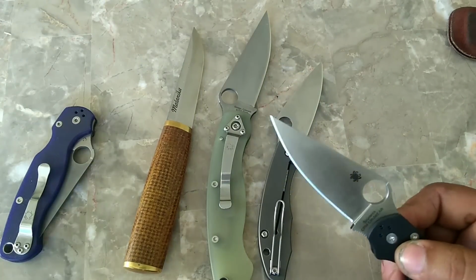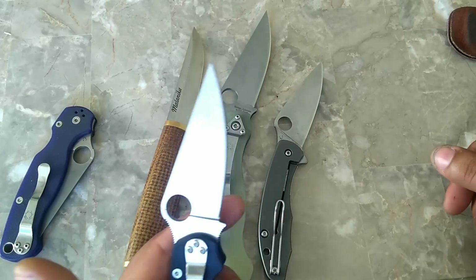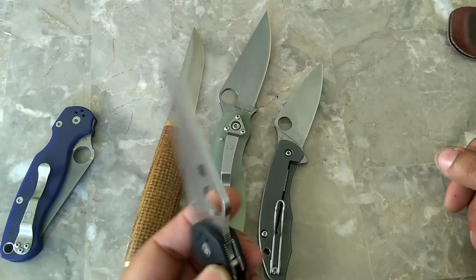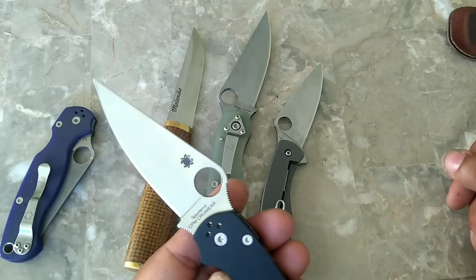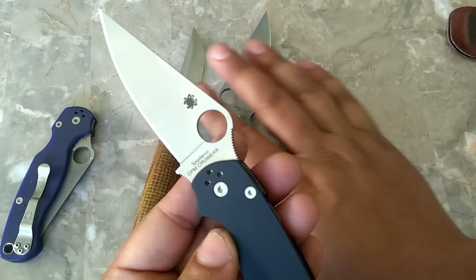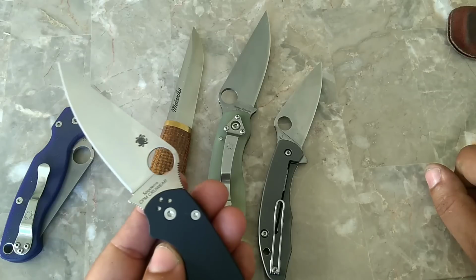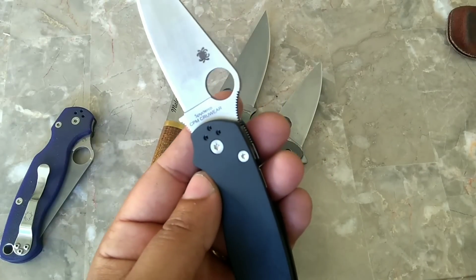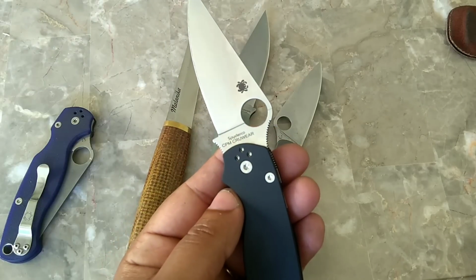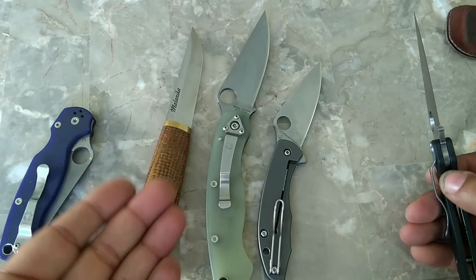But what I am saying is that Cruwear, how Spyderco's heat treating it, it seems like it's not very reactive. It doesn't seem like it takes hardcore pitting, rust or staining. It definitely will. It's not a stainless steel, but it's not like CPM M4 in my experience. M4 is kind of notorious for being quite reactive. Not as reactive as something like a Shirogami #1 or 52100, but M4 is definitely a more reactive carbon steel. It is a carbon steel.